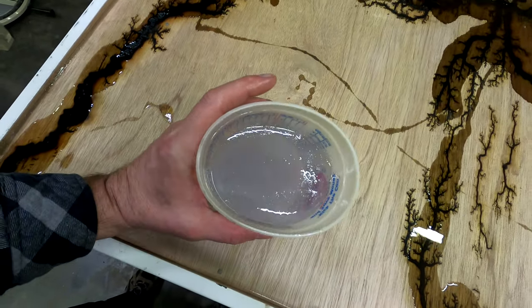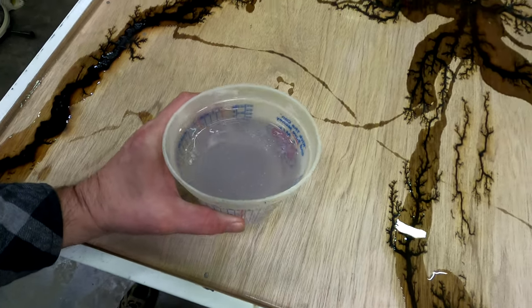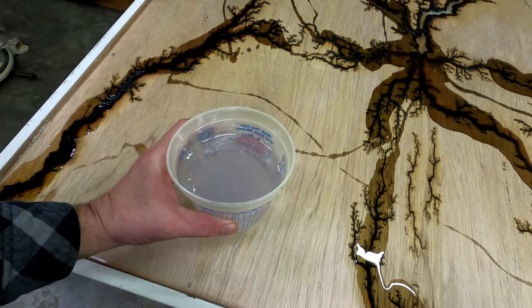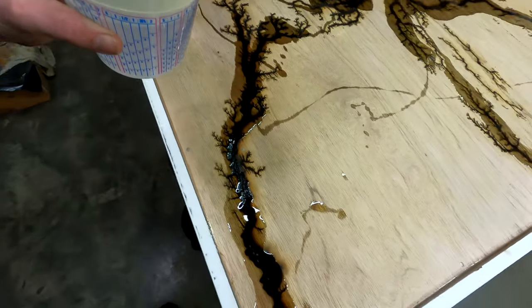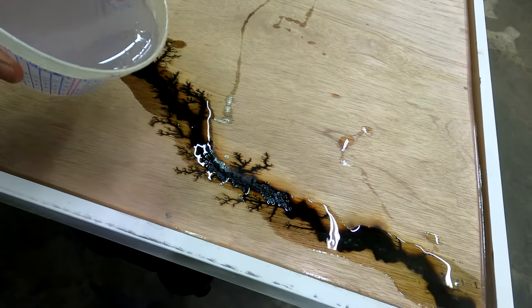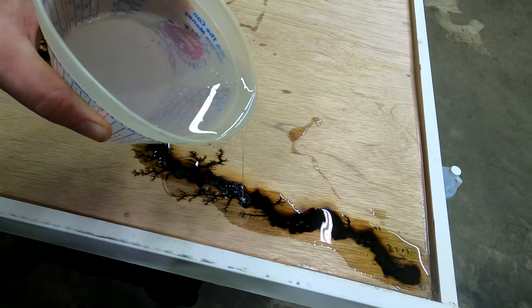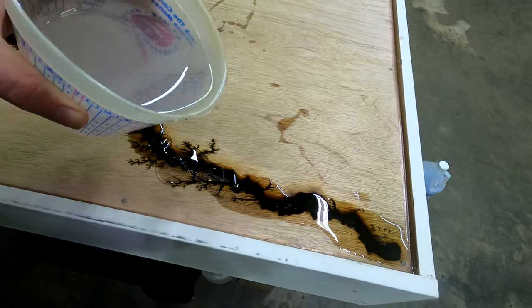And around 5 minutes of mixing. Got a few air bubbles in there, but I'm not too concerned about that. I should be able to take those out with my heat gun once I've laid this down. So we're just gonna fill in the gaps here where I've noticed that the epoxy's run through the table. Try to limit how much I'm pouring on here,